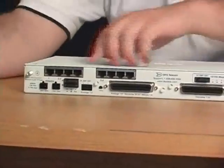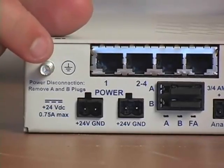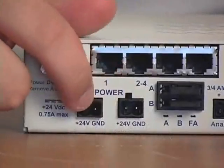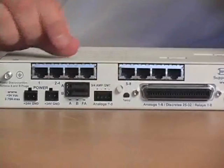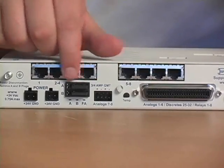So let's take a look at the back panel. This RTU certainly has no shortage of connections. Starting from the left side, we've got the electrical grounding lug to reduce electromagnetic interference. Then there are dual negative 48-volt power feeds A and B, along with dual fuses A and B, so you still have power if a feed fails. Those are also available in negative 24-volt and plus 24-volt, as well as a wide voltage range model. Across the top are eight RJ45 serial data ports for the terminal server. When you get an alarm from a monitored device, you can telnet to that device and try to correct it — way better than driving to the site or buying a separate terminal server box. Anytime you can access gear that's hundreds of miles away, you're saving a huge amount of wasted time and fuel, and you don't have to buy an extra terminal server because it's integrated right in the remote.